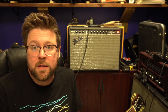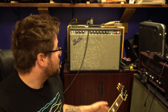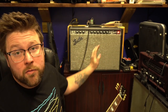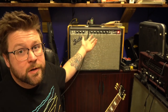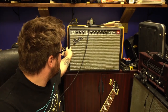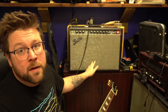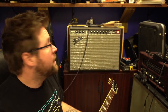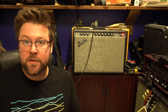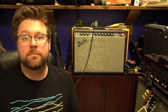But yeah, I'm happy with the way it sounds. Any little modification I can do to make it sound better I'll do on this amp. So right now we've got the Creamback speaker from Celestion, we've gotten rid of the bright cap so it sounds less shrill and trebly at lower volumes, and we've removed the material on the sides of the baffle where it connects to the amplifier so it's wood-on-wood contact — we removed some tolex and stapled the grill cloth back a little bit. Alright, thanks — I think that'll be it for today's video. Thanks for tuning in to Beckler Guitars and Repair, and we'll have more for you really soon. Thanks a lot.